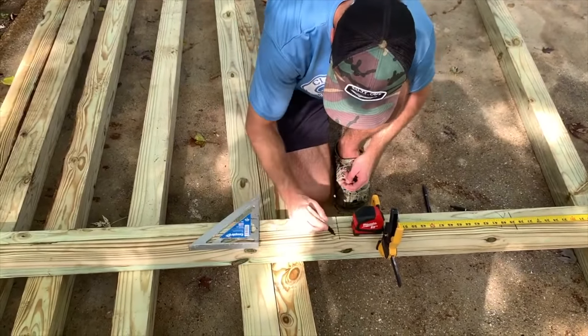You're gonna have this protective film on both sides of the acrylic panels. At least that's how it was for the ones I bought. So after pulling off the protective film, what I did is I took some liquid nails, and really any construction adhesive will do, probably something for the exterior since it's gonna be for a shed, but you're gonna put a bead of this adhesive around the entire perimeter of the shed window.